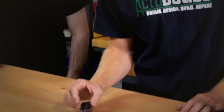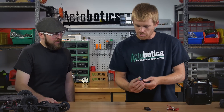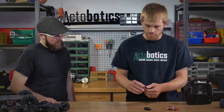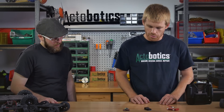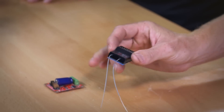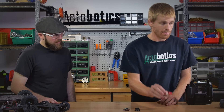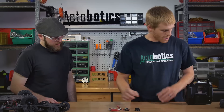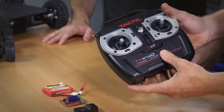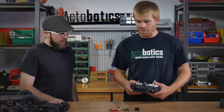I've actually picked up some components on the way in. For starters, we have a motor controller. This motor controller is a two-channel, five-amp, and that's good for the Runt Rover series of robots. So you have the motor controller that you're going to tie the motors into, and then you're going to have a receiver that is going to be sending a signal to the Roboclaw motor controller. Those two are going to be linked together. You're going to have a battery to power both of those. And then you're going to have your wireless link to your receiver, which is going to be the handheld device called a transmitter. It's going to be sending a signal to the receiver for the motor controller to pick up and operate the motors.